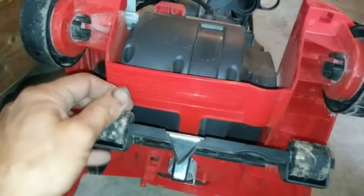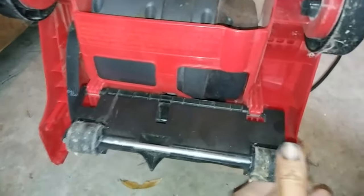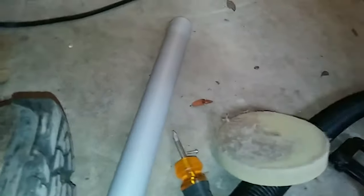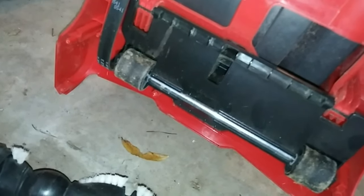Anyway, I'm going to have her clean that up. Clean your wheels off and just maintain it — do this once a month, or whenever you clean your filters, give it a good check. These filters are just foam. Rinse them out real good, squeeze them like a sponge, and let them air dry. Same way with this — wash with cold or warm water. You can blow dry them too. I wouldn't recommend putting these in the dryer; I just let them air dry. It only takes a few minutes for them to dry. Put it together and maybe let it dry a little longer before you turn it on — that should take care of your problem.